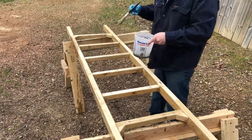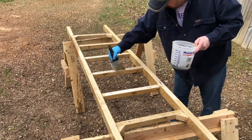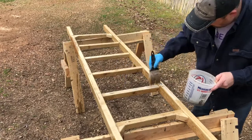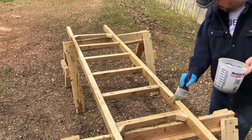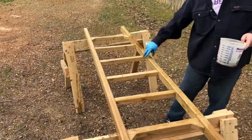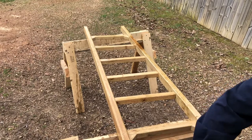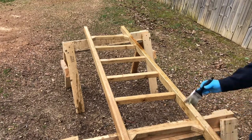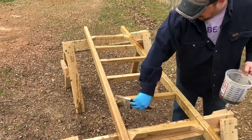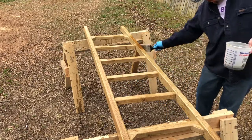We're going to take two boards that are three foot long, and we're going to cut both of them at a 45-degree angle. And I think it's called a cleat. I can't remember what it's called, but that's what we're going to use to hang the ladder with. And we're also going to take, I think they were 2-inch little blocks, and we're going to use that as spacers to keep the ladder off the wall.